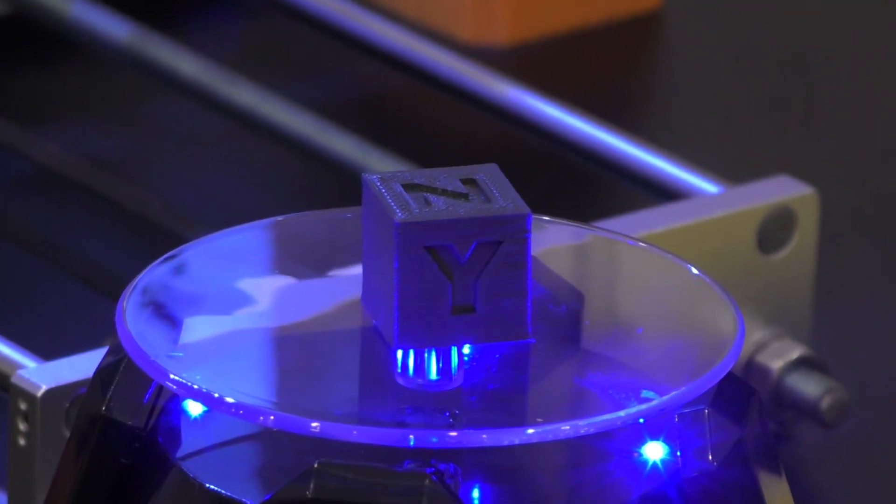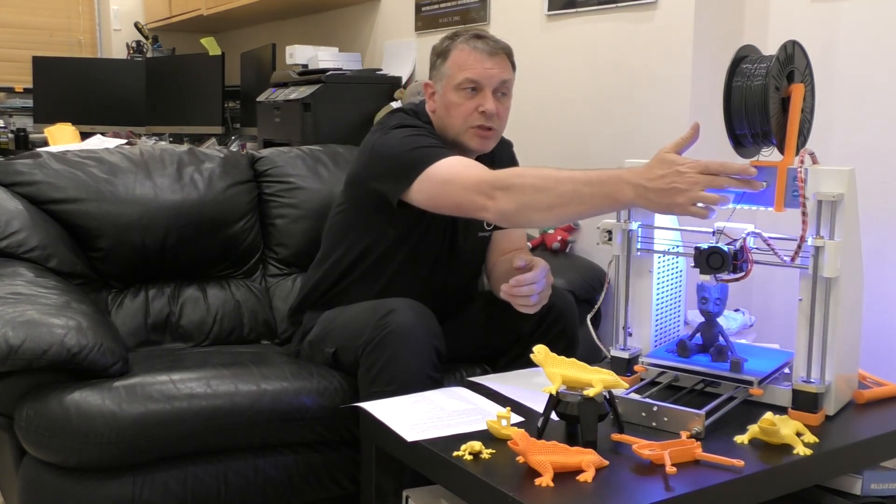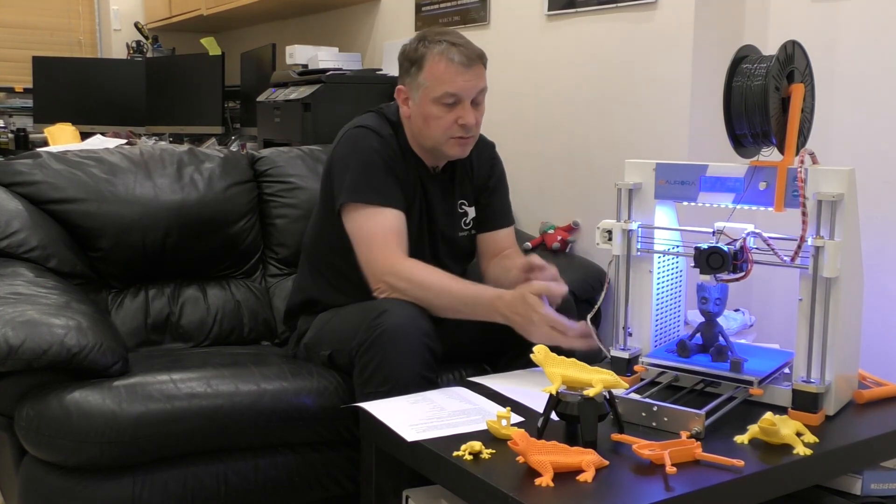So would I recommend this? It's available mostly from Amazon worldwide, and in the UK it's about £300 at the moment. Without the modifications that I've done I probably wouldn't recommend it, no. But with the modifications, and the modifications that I've printed on this machine, yeah, I probably would. The prints that it's done are really good. But if you are building one, check out your X carriage for play, and also check that you're not suffering from major wobble when you're moving the machine at the top - it got to the point where you couldn't even press the button without lifting and lowering the bed nozzle. But since I've added the feet it's improved 110%. That's about it - the JG Aurora A3. I hope you enjoyed this video. If you have, please subscribe down below. There will be a few more to come, take care.